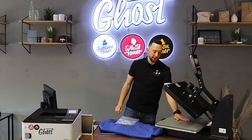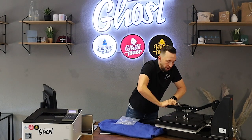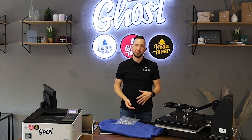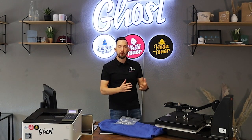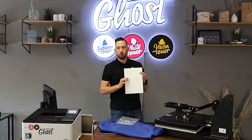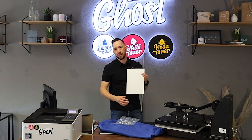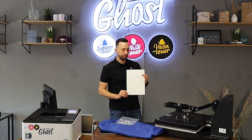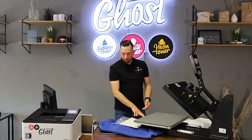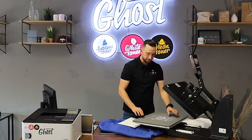Always make sure that the lower plate of the heat press is quite hot. You can quickly give it a pre-press by just closing the press for 30 seconds or one minute at 160 degrees, which is the operating temperature for this application. This is to make sure the lower plate is hot — particularly important to make the glue from the B paper transfer to the toner on the A foil and ensure a good and clean separation in this process. After preheating, I pull out the table and put the A foil on it.